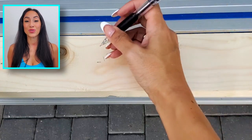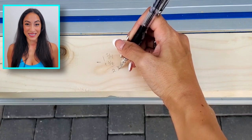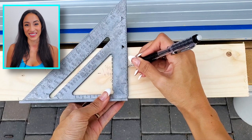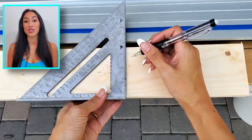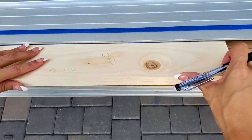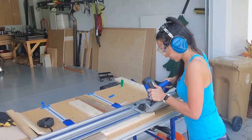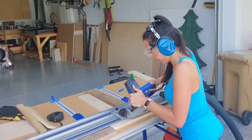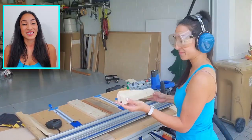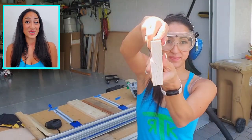Take that measurement and add it to the center measurement of your board. If you have any tips on cutting French cleats, please put it in the comments below so we can all learn. Now we finally have the measurement for lining your track onto the board. Having the larger side of the board away from me, just like the blade will be. With the track clamped into place, I ran the saw, pressing it into the track since it's very off balance being on the 45-degree angle. You can see how excited I was since it was the first time I made a cleat and used the track saw.